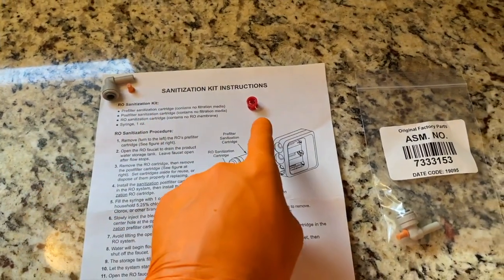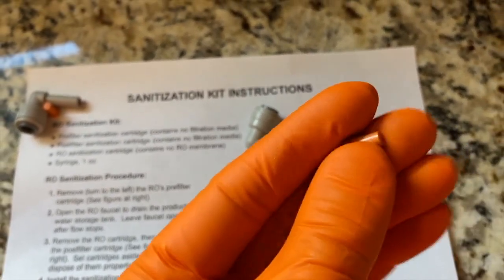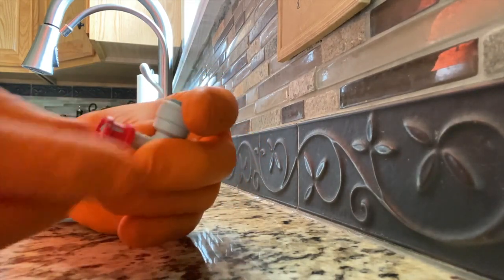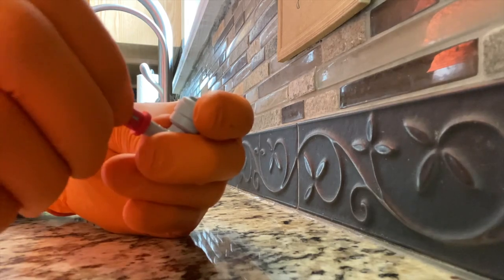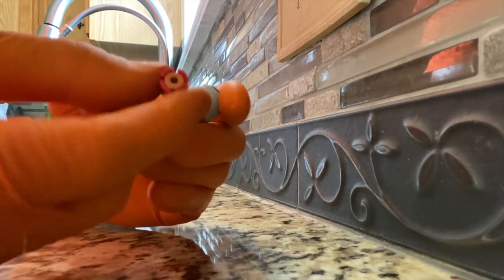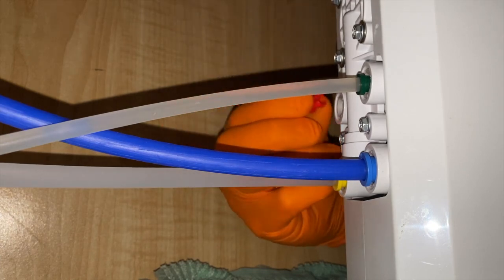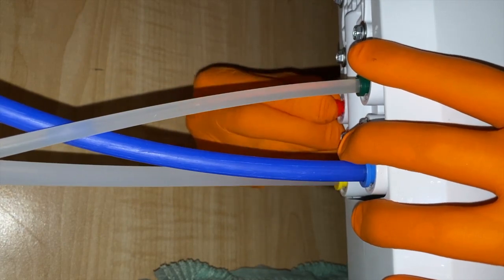Back up top — old restrictor on the left hand side, the red insert, and let's open the new part. New part is out and I want to show you how tiny that little hole is. If that gets clogged, the flow restrictor will not work. At this point I am going to reassemble everything. I've got this part and I'm going to shift the red connection on — it will stop. From here I'll take the orange insert and insert it inside that hole. If I took the entire red piece off, the orange insert would come with it. I'll realign that and put it back in. I'll go back down below and reinsert it into the filter case. I've now taken the parts back apart — I only put them together because I wanted to show you what they look like. I've got the red insert and I'm going to carefully align that and pop it in the rear portion of the case. And that's in there now.